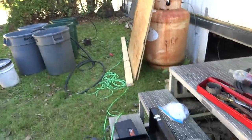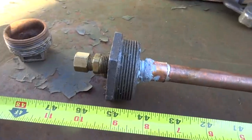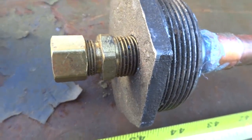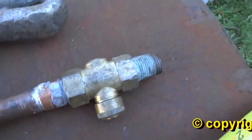I'm going to come off the top of the tank because he's running regular — he's not running kerosene like he's supposed to. I put a fire-o-matic down there with a plug. The top of the tank is like 45 degrees — this is off the top of the tank like 45. I put in this duplex fitting; it's got a thread here. I'm going to come off the top with 3/8-inch black pipe, do a fire-o-matic and a filter. And I put a check valve on the bottom.